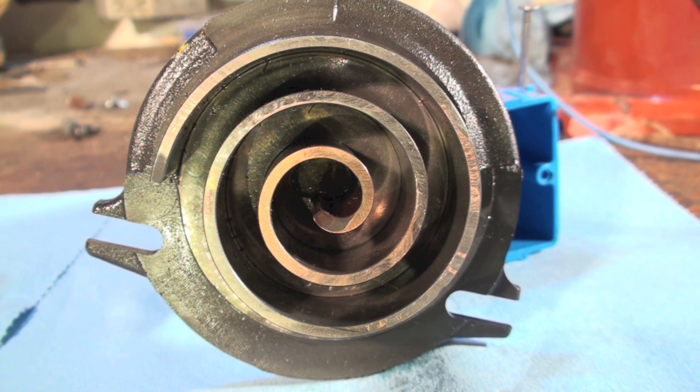Because the clearances are so close, if you get any copper plating from moisture and air in the system, that copper fills up that clearance and locks it up. So you end up with a locked rotor compressor. This was poor service work — poor installation. Someone got moisture and air in the system, and that's all there is to it.